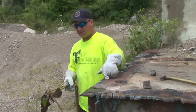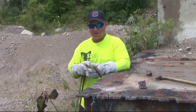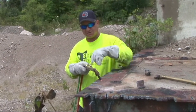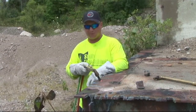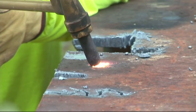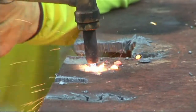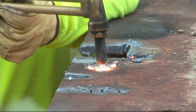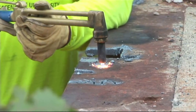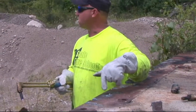If we're going to do a pierce cut — after we want to make a hole, like with some rigging — you do the exact same thing, only you've got to preheat it in the middle of the metal. You want a pretty hot flame for doing this, because there's a lot of surface area you've got to preheat. Then just start the same thing, hold it at 90 degrees to the work piece, and start working it out. When you get done, it's going to look like you're about to throw it into the drill press, because you've got a good spot going.